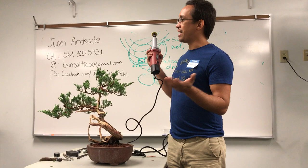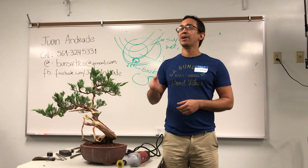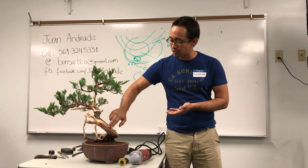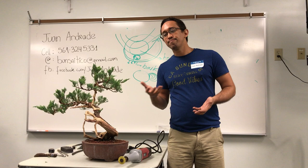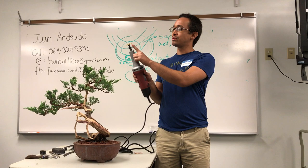You can get these on Amazon, eBay. I think the maker is 3M, the tape maker. Harbor Freight sells the actual wheel in different grits. You want the higher number because that's the finer grit, and with fine grit you preserve more detail. If you have really big cut marks, you want a more coarse grit to smooth them out. But if you want to bring detail out, you want one or two wheels at the top.